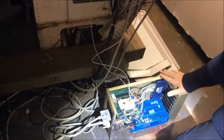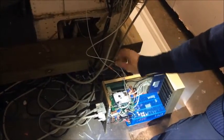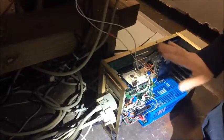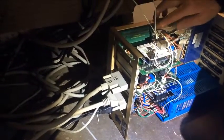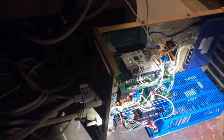Down here is my I/O box, which has input-output for all the switches I have interfaced so far. This is kind of a temporary setup — I had an issue with the wiring going out through my data connectors, so I've got my 28 volts and one of my tachometer leads coming out here just for now. I want to make sure there's no problems with interference or EMI. If this system works and is stable, I'll reconfigure my connectors and get rid of these wires. The box uses an ISA backplane with a built-in power supply and a network switch — all these are network-enabled.